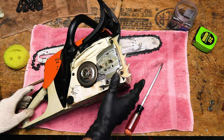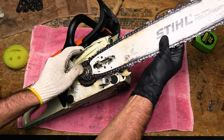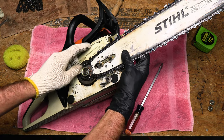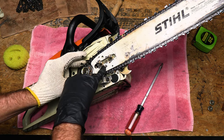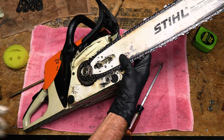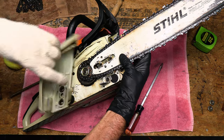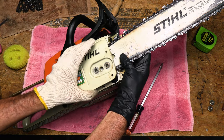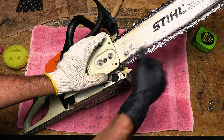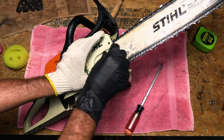That pin should line up with room to spare. Just put your bar in there and see where the adjuster pin is — it had enough give in there. That pin goes right through here, and that's what moves the bar back and forth to adjust your slack. I've already cleaned all that up as well. So just put your cover on, kind of holding the bar up while you're doing that. Make sure the chain will turn — I can see it's really loose, but that's okay. Just kind of get your nuts started on there.